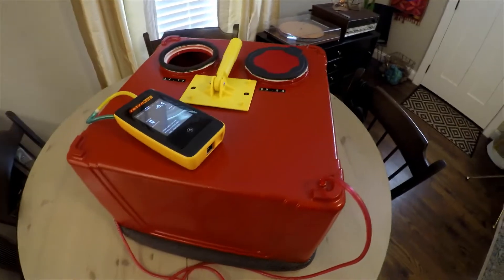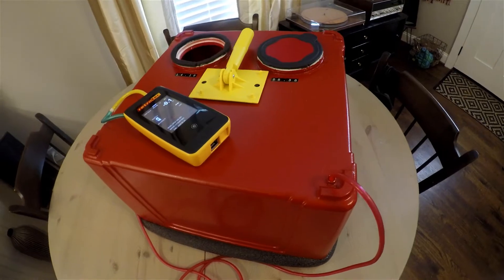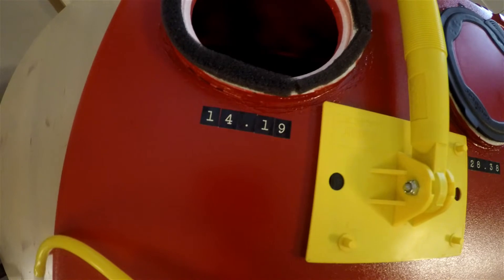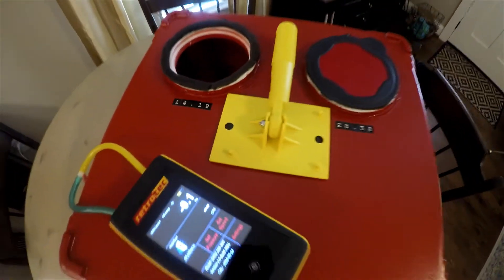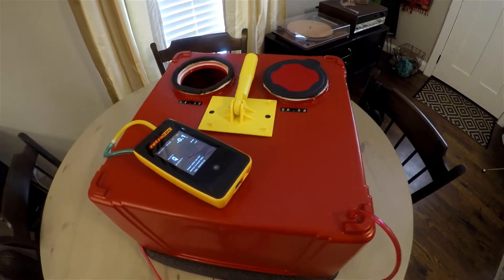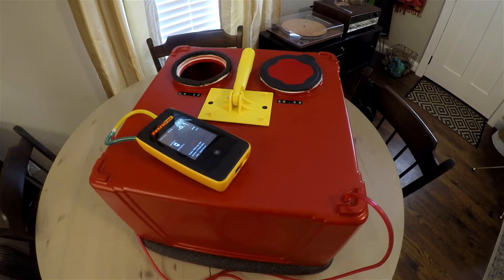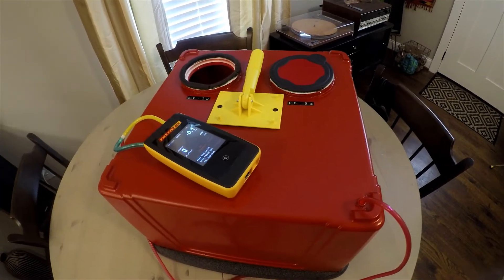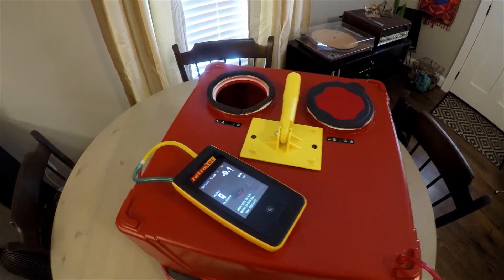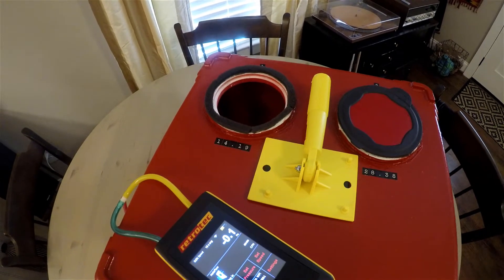I would recommend that if you're not going to use circular plugs, cut a square or rectangular hole. That way you have a nice round number without a decimal, which makes it easier to figure and remember the area. You can use rigid foam board as your plugs for a good seal as you cut different holes. But if you are going to use circular holes like I did, definitely use a hole saw and some kind of factory-cut opening to reinforce the edges so you know exactly what the area of your circle is.